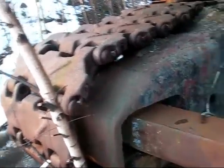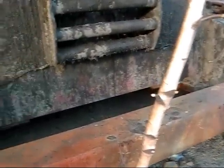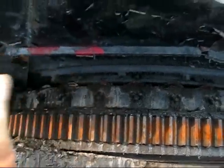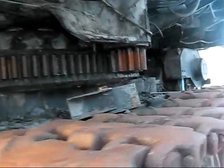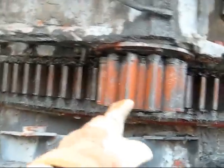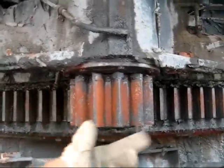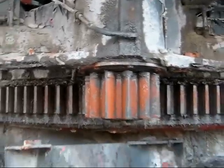This big bar that runs across and connects both crawlers together reinforces them so that when the machine is tramming, the crawlers don't tend to bend or twist. Right here you can see the ring and all the individual rollers that swing the shovel when it's running. The 195B has two swing motors mounted 180 degrees from each other on each end of the ring, providing better contact area for the swing gear and helping wear the ring more evenly.